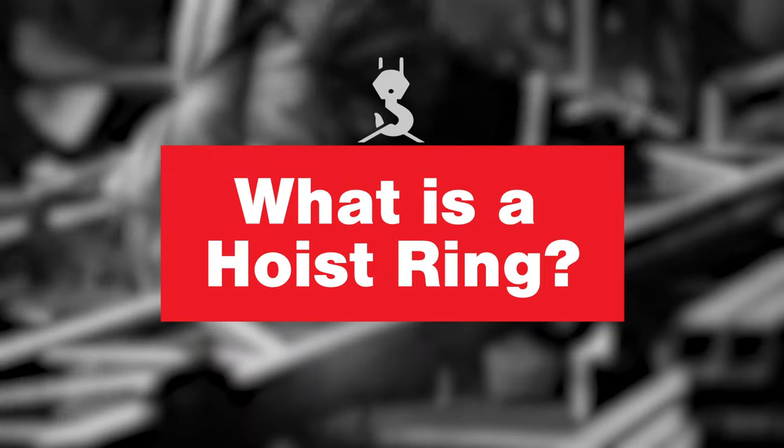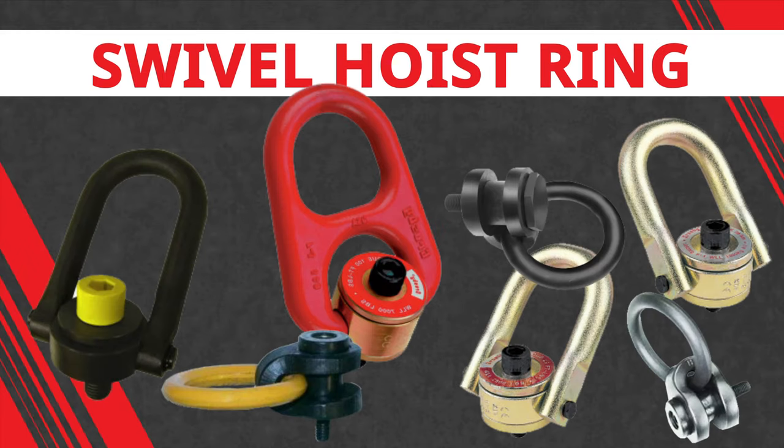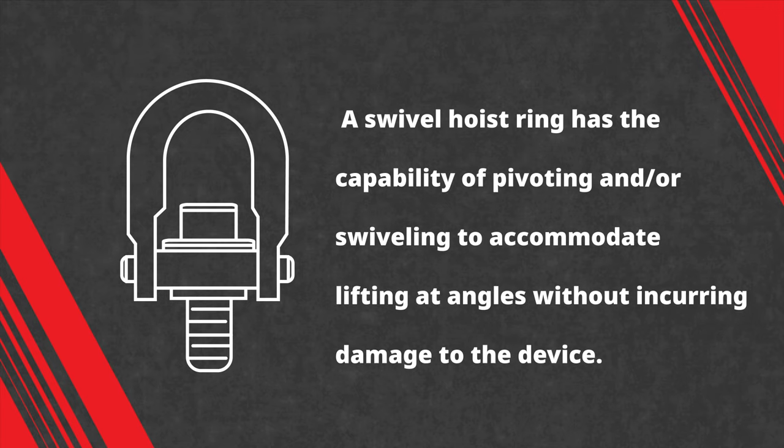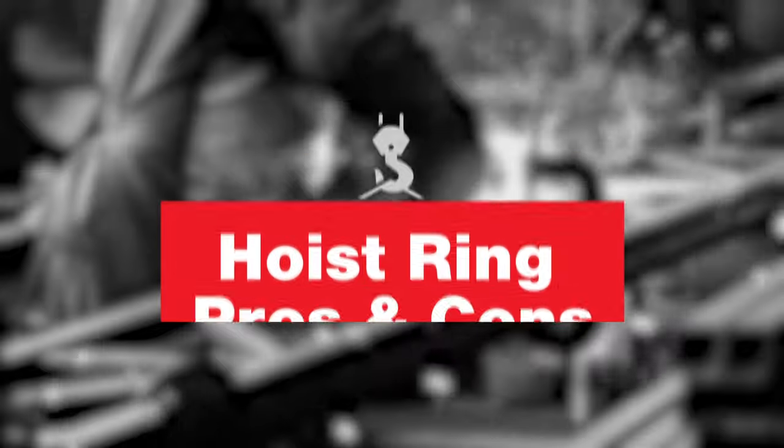What is a hoist ring? A hoist ring, sometimes referred to as a swivel eye bolt, is a piece of rigging hardware that screws into an engineered lifting point on a load. The function of a hoist ring is similar to an eye bolt. However, a swivel hoist has the capability of pivoting and swiveling to accommodate lifting at angles without incurring damage to the device, whereas eye bolts are stationary and can only accommodate angular lifts by factoring in a significant reduction to the WLL. Because hoist rings have more moving parts, they do come in at a higher cost than eye bolts. However, they tend to last longer and are usually repairable if damaged. Learning to use and inspect these devices is more complicated. Hoist rings also require the use of an additional tool — a torque wrench — to ensure they're properly torqued into the load.